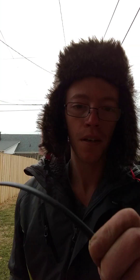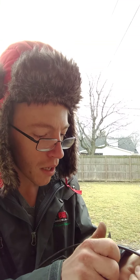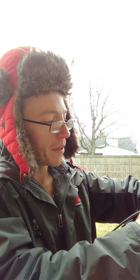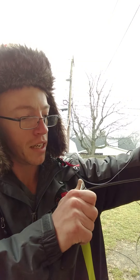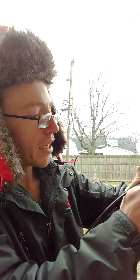So I'm gonna take this right here and score it — let me show you how to do that. I'm gonna take it where my finger was and just score around here, and you'll see why that's important in a second. Then I'm gonna start right there. If it's flat right here, I'm not going to shave off right here — I'm gonna kind of go at an angle on the top. So I pull it, make sure I get into my little scoring spot, and then I'm just gonna start pulling. I'm gonna pull out about five feet or so depending on how well it starts stripping for me. The trick is to hold the side where your knife is as still as you can and then pull with your other hand. That way your knife stays the same the whole time.